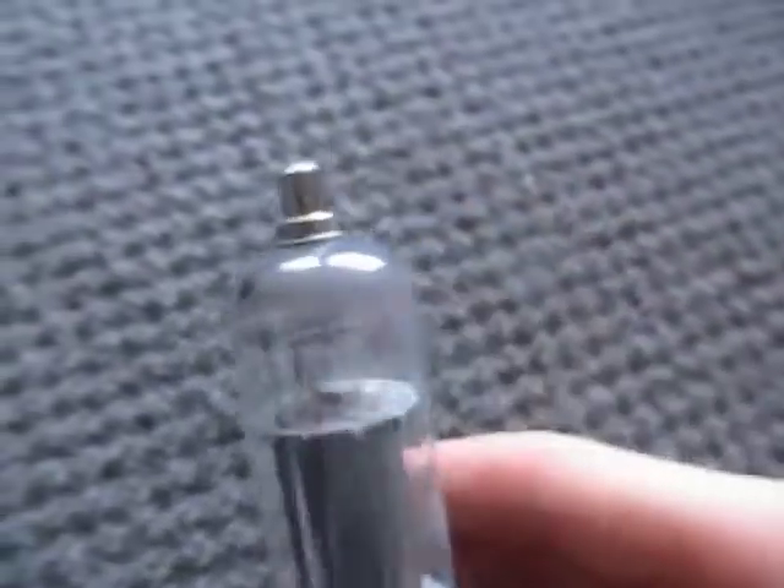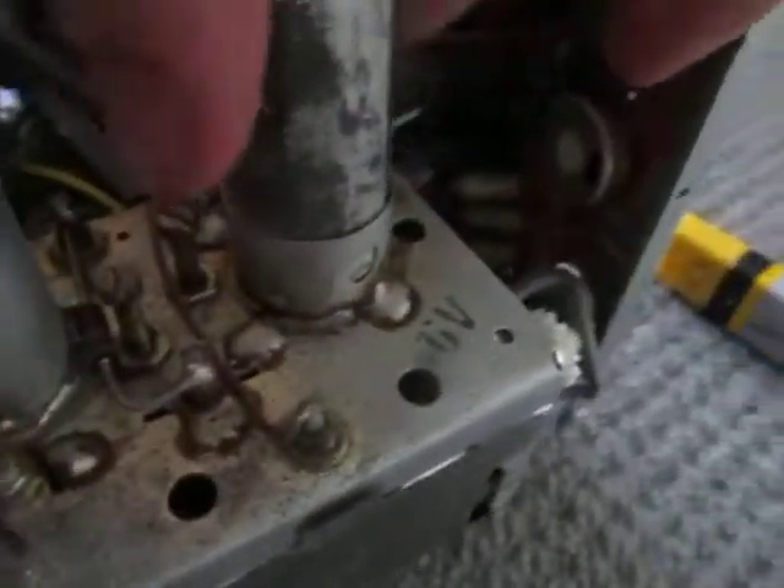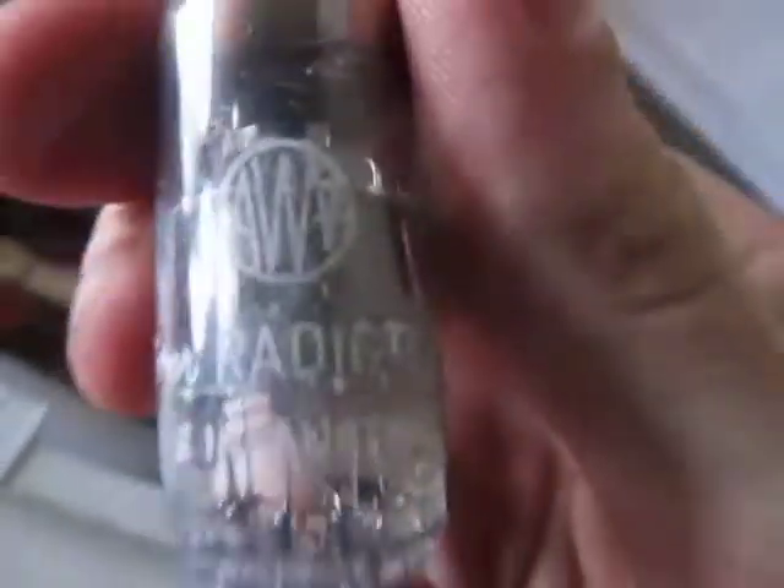And there's a couple of PAL ones. This one I believe may have a bit of an issue because the getter material on the top of it is not quite as silvery as it should be — it's gone kind of a funny opaque whitey colour. I'm not sure if that would be indicating a loss of vacuum because it's still functioning and this isn't a really pure white; it's more of just a light smoky grey colour. It's got a whole bunch of valves and a lot of them are triodes and similar ones like these little ones — AWV Super Radiotron tubes.